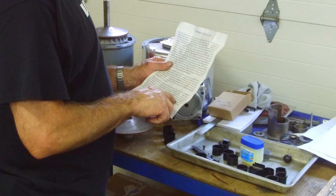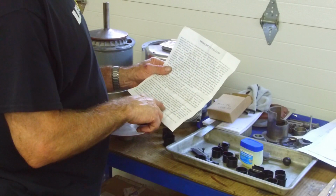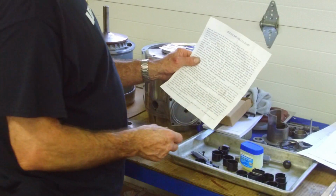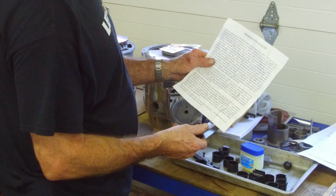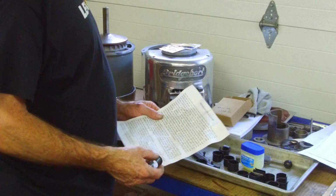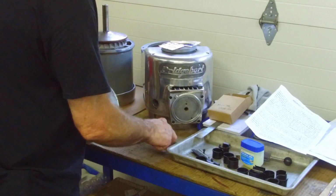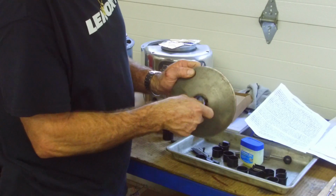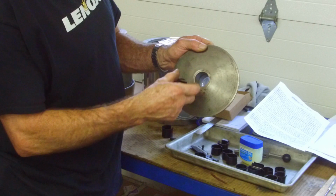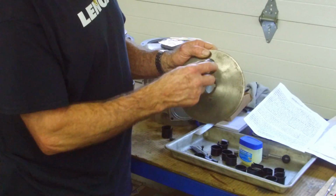Okay, mix epoxy and apply to the inside of pulleys. Insert the keys, bushings, and slide them into the shafts approximately running position to ensure perfect fit. And then clean off your excess grease and epoxy. But it also makes sure that you clean the inside grooves. It's because these bushings don't go in from the outside and shoulder to the outside. That shoulder registers into that groove, so that the bushings, even if they became loose, they would not travel.